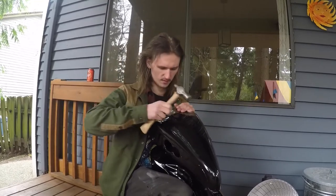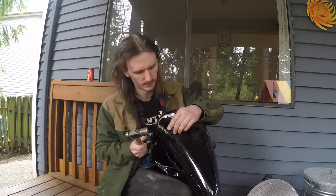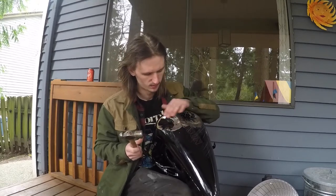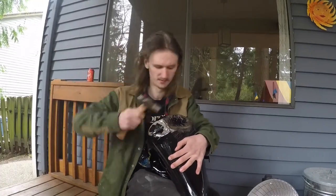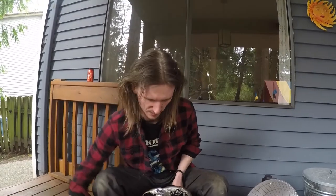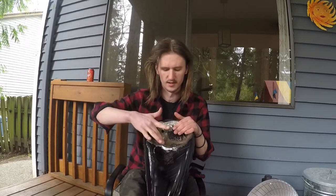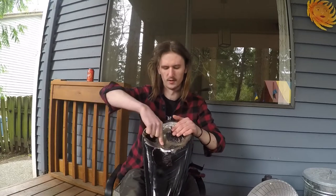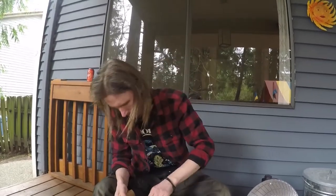This crease is getting to be a problem. I kind of like the way this paint is coming off — it's actually quite smooth here. Won't matter though, because it's all scratched up up there. So I'm starting to flatten that crease now. It was getting pretty sharp, which was concerning me a little bit, but I managed to get it a little better back here, which means I'll be able to work that up and even it out. I got that crease almost back where I want it. There'll probably be some little stress marks on the metal there, but that should be okay.